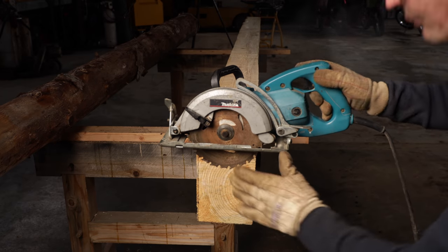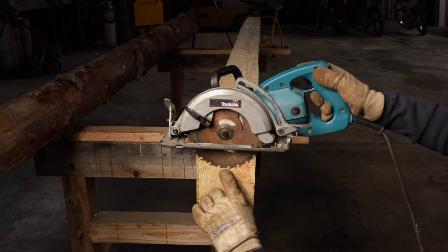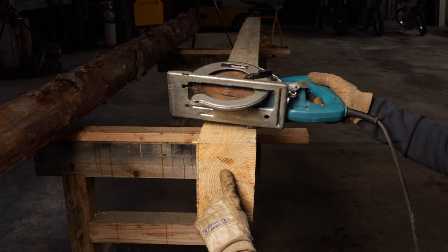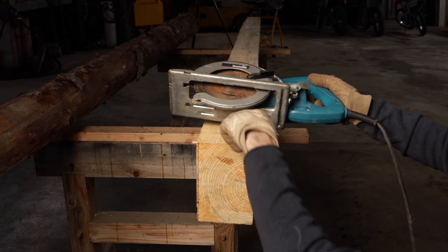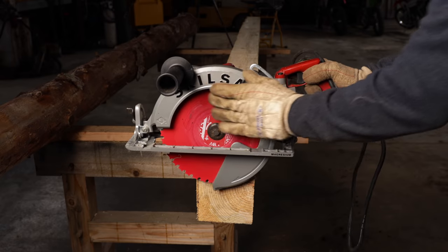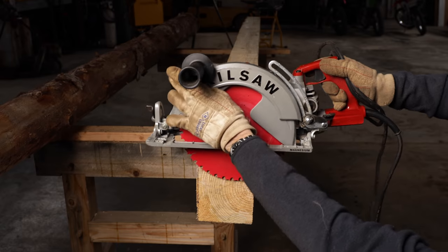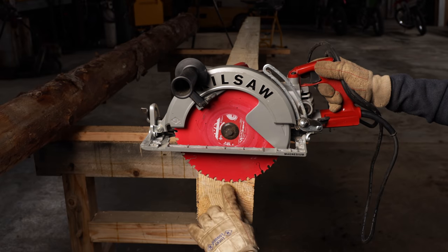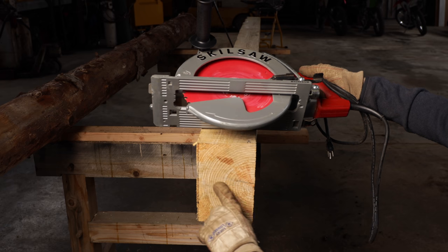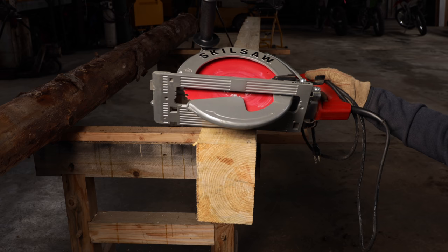What I was hoping to show you was the maximum depth of your traditional skill saw. We have a four by eight here — you can see when everything's said and done it isn't cut very deep, so if you need to cut a beam you've got to cut from all four sides. Now there are other options like the big skill saws. We're getting up into a ten and a half inch blade, which is a lot better, but even there we're still unable to cut all the way through — we're probably almost to the midway point, so we're still looking at two cuts.